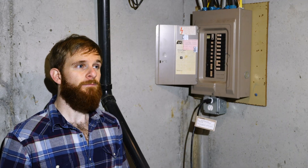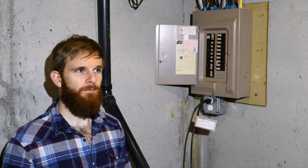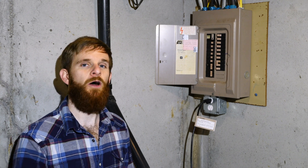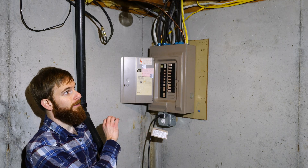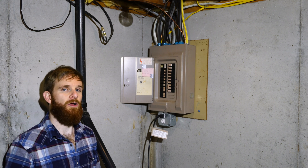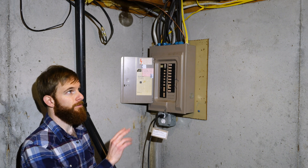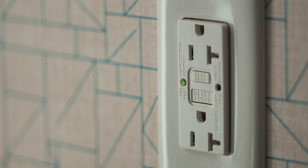Now I brought two 20 amp lines, but some people bring just one larger wire and then have a mini breaker box in their woodshop. I actually wish I would have done that — it would have been a lot easier to know which lines go to which machines, because you can label the mini breaker box, like 'dust collector,' so you know what tripped. However, that large line is a little difficult because it's very thick and very expensive. So I found it a lot more cost effective just to route two 20 amp lines without an extra breaker box — all I had to buy was the two 20 amp wires and the electrical outlets and boxes in the garage.